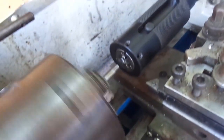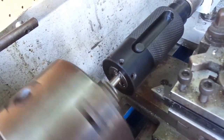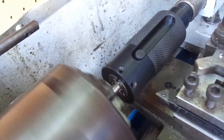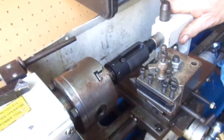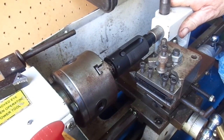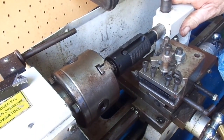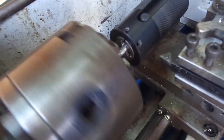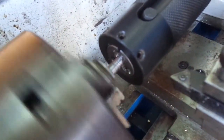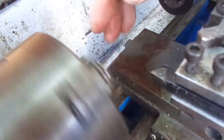At that speed, it's fine. There she goes — just cutting. And then we're going to put it in reverse, we're going to uncut it, and we'll go out backwards. And there you are — you've got a beautifully formed thread.